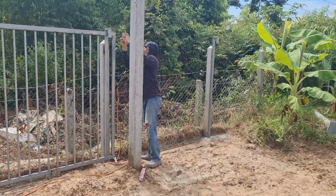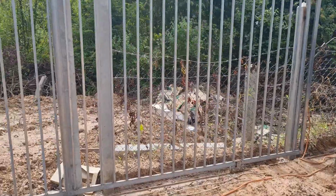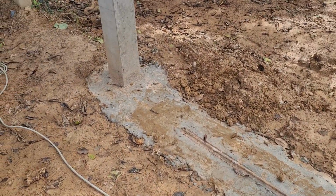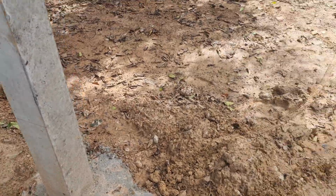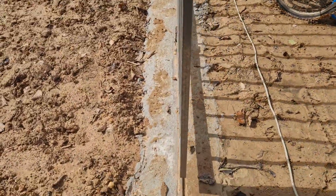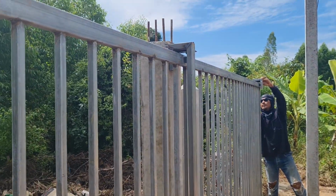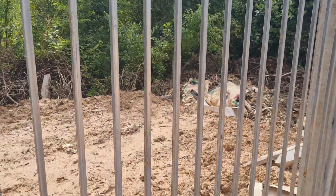Today Mo fits the gate, puts the rollers on the gate. The foundations are 6 inches down, steel and concrete, and the posts are concrete, maybe 500 mil down. So then it's on a steel runner and steel rollers. Then he builds another frame here to attach to the posts with runners on it as well. So there's 3 of them. So all in all, a solid gate.